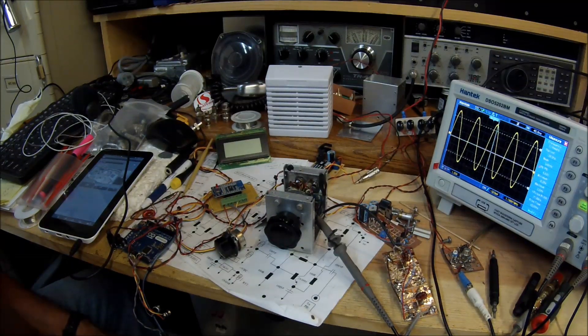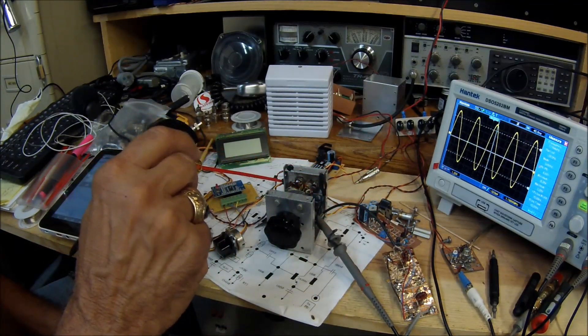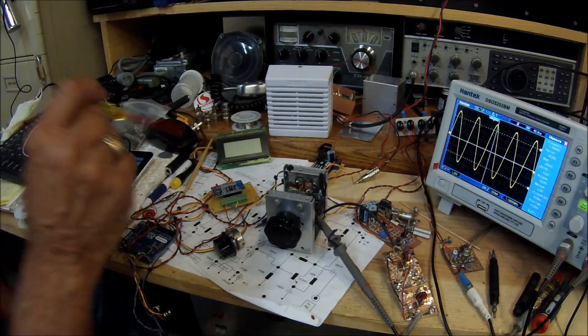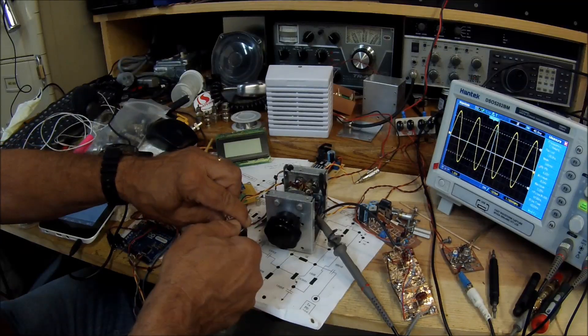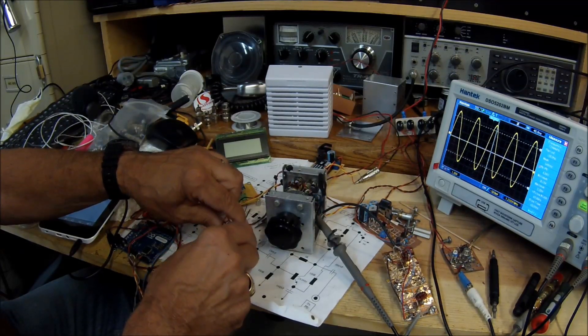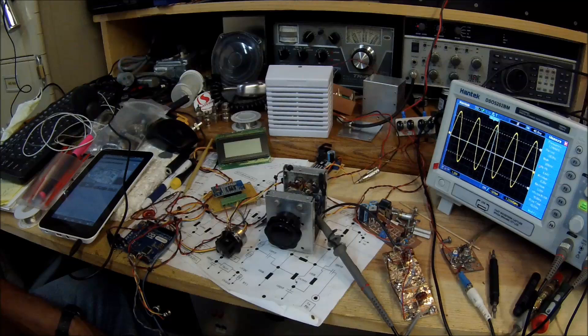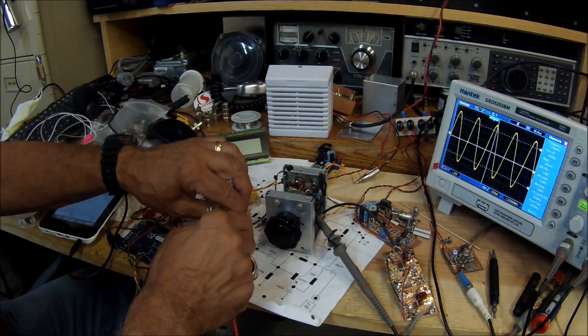This is N6QW and this is Part 1 of "Let's Build Something." Again: double balanced mixer, audio amplifier stage, a VFO acting as a local oscillator, and a single transistor RF stage. It is kind of amazing — I have had this working on the DDS on 20 meters and we are hearing DX on this. You don't have to have a lot of components to have a very high performance receiver. In the final configuration we will include a low pass filter and a band pass filter ahead of this, because this RF amplifier stage is amplifying everything coming off the antenna — so we do hear a little WWV in the background.